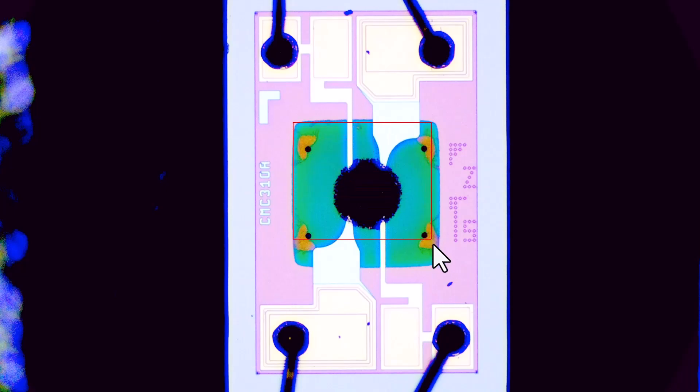It's a closed membrane hot plate. The membrane dimensions are roughly 300 by 300 microns - it's a square membrane. There are four relief holes on the membrane corners. In a square membrane, the membrane could flex as the micro hot plate heats up, creating pressure on the underside that could potentially delaminate the chip. Stress points concentrate at the corners, so rather than filleting the edges, these relief holes allow hot air to escape from the back side, preventing the hot plate from flexing - quite a neat engineering solution.